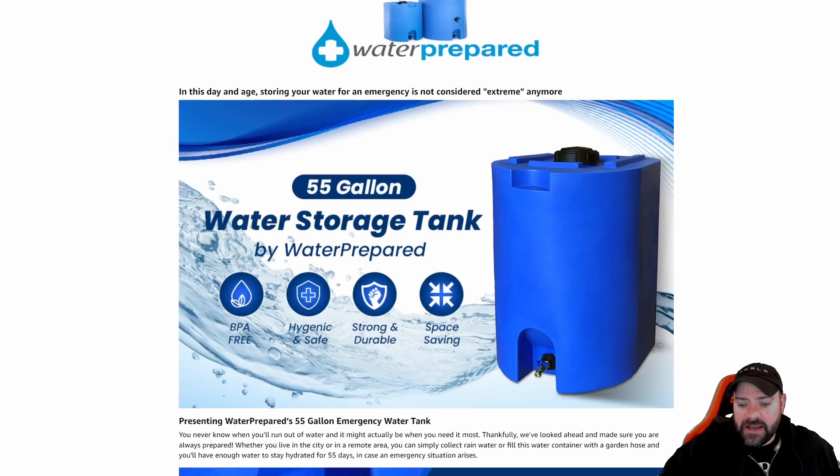Let's get into cleaning and preparing these for water storage. I utilize a double filter system — a paper filter for sediment, and a carbon filter for taste for the main house. It's hooked up to my hose, connected to the well. We also added an RV filter as a third line of defense against anything in the well, for taste and storage. The water comes out crystal clear — I actually just wanted to drink it.